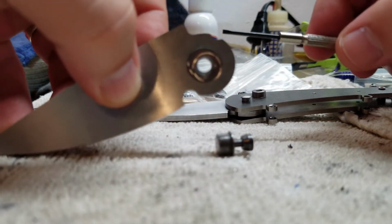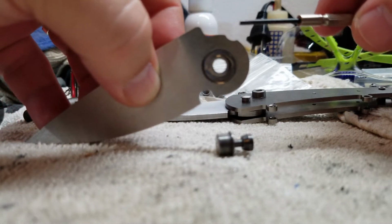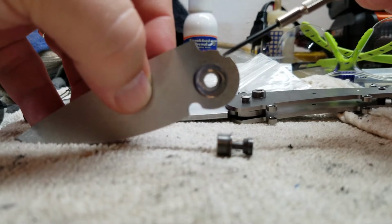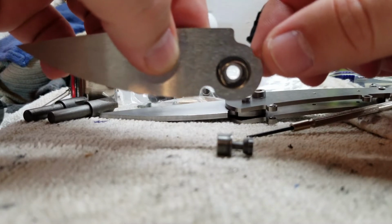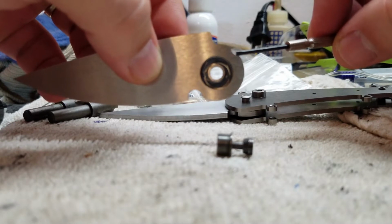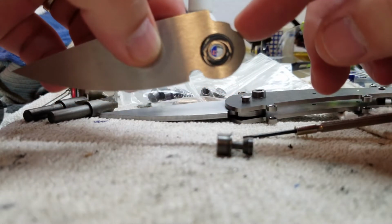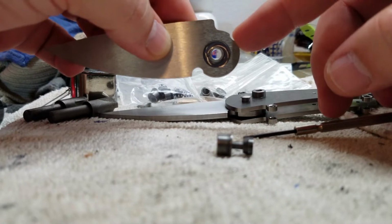Now this notch, the detail of this notch, what I've figured out and then talking with a couple people and so on, there's a couple different ways of doing this. So I could try to get the circle of this notch to perfectly match the round bottom portion of that button. But in doing so, that actually kind of keeps it from rotating this thing up against the stop pin. So I want the stop pin to be fully engaged on this flat. So actually I want this slot to be moved up that way just a little bit. And I'm talking not much at all, but just a little bit, so that when the button's trying to fit in that circular cutout, it rotates this blade up against the stop pin, and that's what's going to hold it solid.